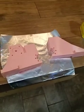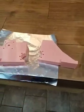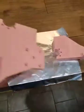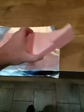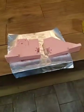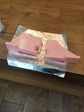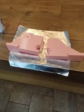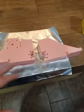Day 6. Yesterday I spent most of the day waiting on these two prints. They're really big. Just to give you an idea, that's one half. This is another half. This is going to be the shell carrier, and yeah, it's just plastic. I'll probably reprint these hollow at some point and fill them with epoxy so that they're really stiff and rigid. But for right now, I just need something to align the ball screw and the rails with.